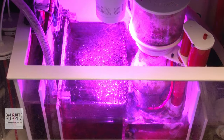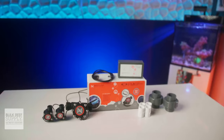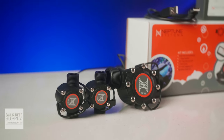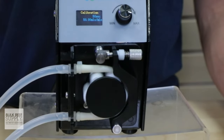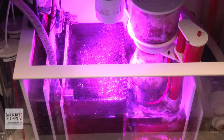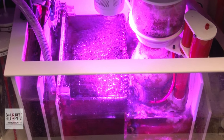Because water passing through the drain is also unfiltered, there is a higher risk of clogging, which would be a big problem. Flow sensors also have minimum and maximum flow rates that they can handle. If the flow rate is too low, the sensor won't be able to register it. If it's too high, it could damage the sensor. So it's important to size the sensor to the equipment you're intending to use it with.